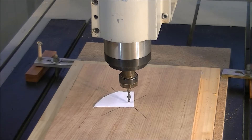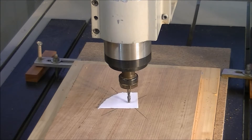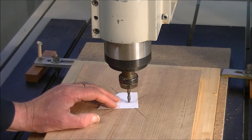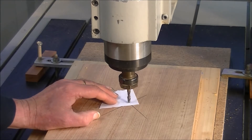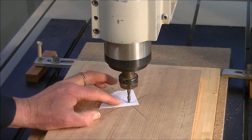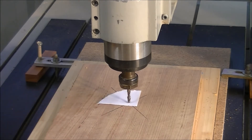All to the jog — be very precise with this. So that's within 2/1000ths, so we'll take it within 1/1000th of an inch now. That's it — just touching it. One more, and that's just grabbed it. So that is absolutely perfect on the material there.